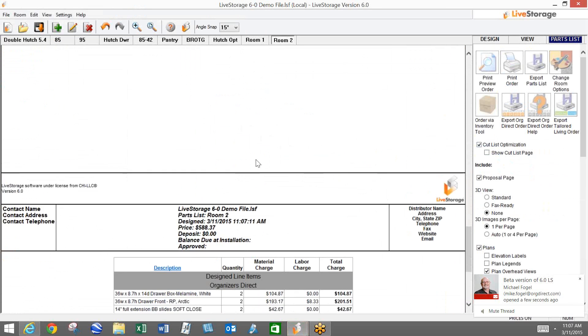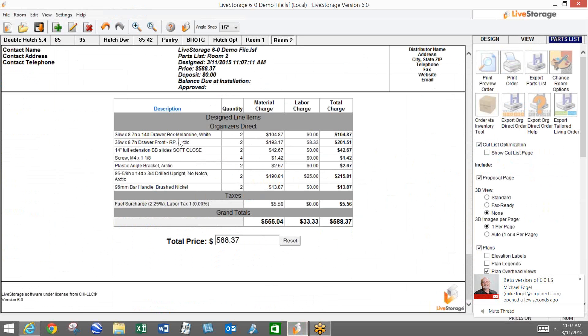Also with the drawers, when we look at our parts list you'll see that we did break them out into four individual SKUs. Here's the drawer box, here is the face, here are your soft-close runners, and down here will be the handles. You're not automatically going to get a handle — that's also going to be controlled by the room options. Make sure you select the correct handle for that drawer. You will also see the correct screws populate on the parts list when it comes to ordering screws for drawers.